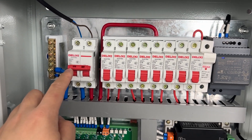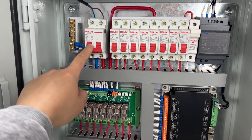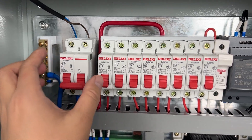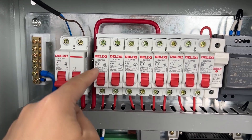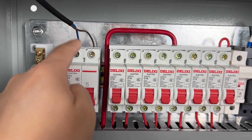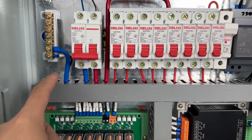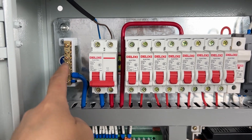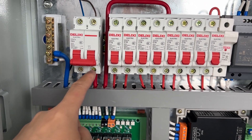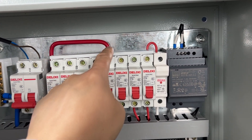You can see here that we can power off, and I will show you some details. Just power off. You can see that is a mini breaker — it is connected with single-phase. If you want to use three-phase, you just replace this breaker with a three-phase version. I use single-phase. That is the live line and the neutral line — you can see the red one and the blue one. The blue one is also connected with this terminal, which is the terminal for neutral.